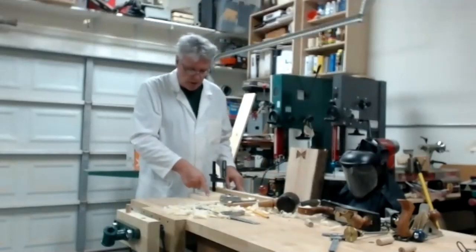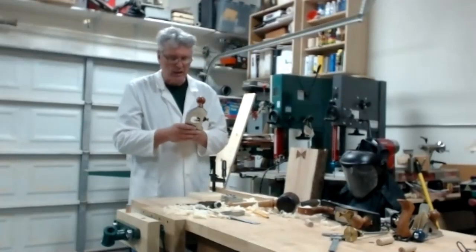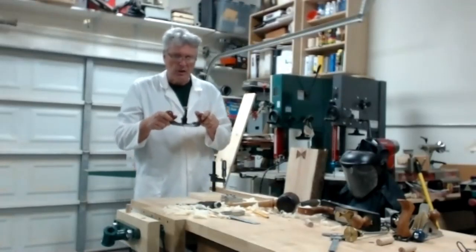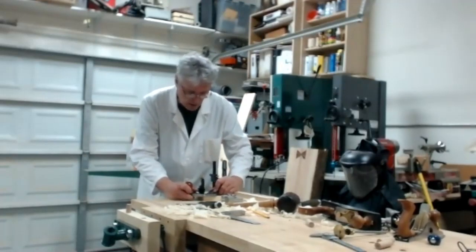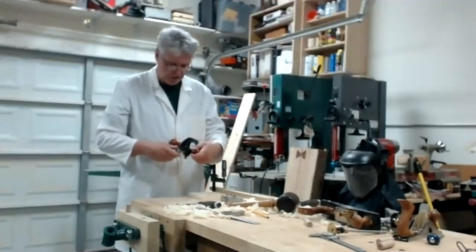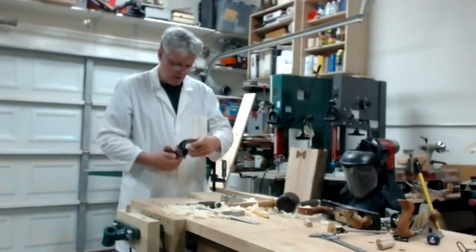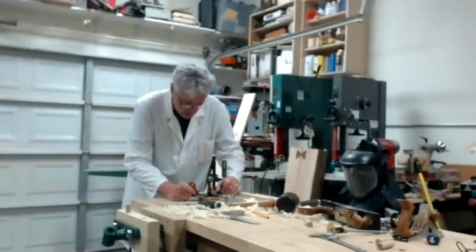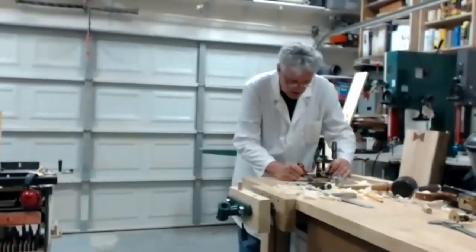Thanks, Doug. Okay, so what I did was I took my one-inch chisel and I scored all around my dado as a starting point. Now I'm going to take my router plane. I'm going to set it about 3/32 of an inch deep for a cut. I'm going to slowly start chipping away. It's a little aggressive cut there. Hang on. One snap for the first pass. You don't want to go too deep in a first pass. You're just looking to define the dado to start with.